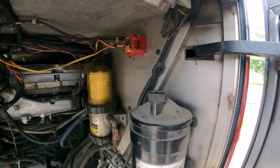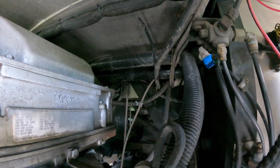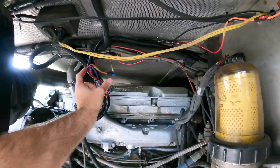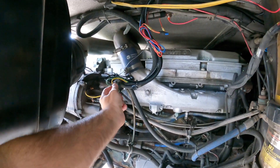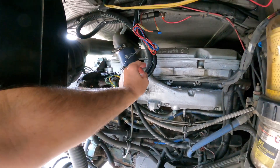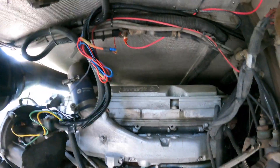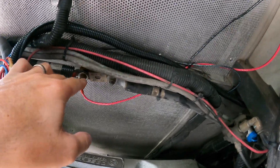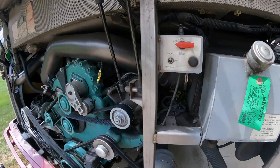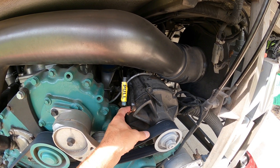I found a conduit back up in there — there are three of them, probably more. I stuck the fish tape up in there and ran the cables back this way, slowly breaking them out of the cable bundle. These are the two for the field and the stator, this one is the temperature sensor, and then I also have the black and the red — it's fused. I found the fuse up here from the alternator. I took the terminals off and cleaned them because they were really bad. On the front here is the black lead, and I made one for the alternator protection device and one for the other black.